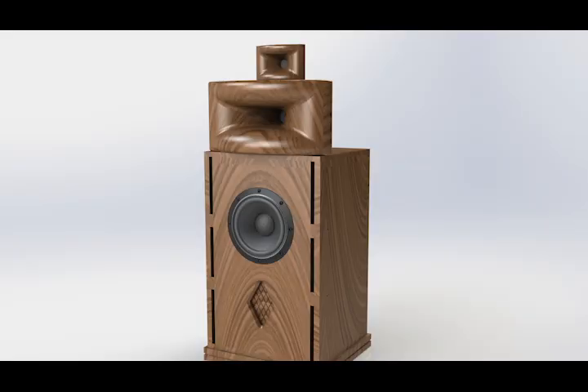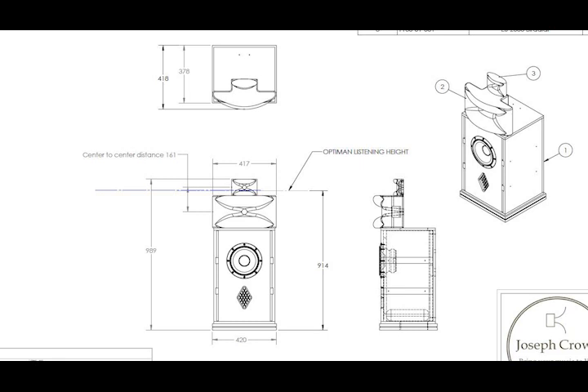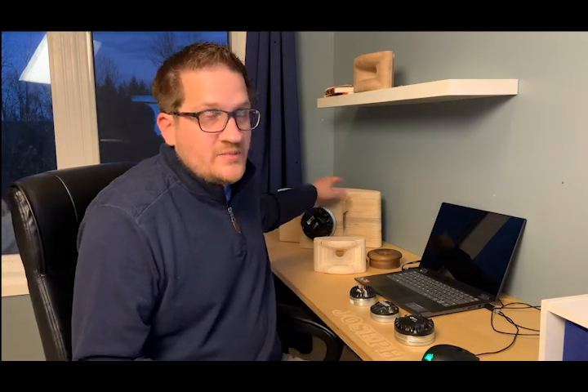The next part of the test involves the Autumn Series — a small three-way system I've developed featuring an 8-inch driver. The idea is that you can mix and match different bass cabinets with different horns to get horn-speaker sound quality in a smaller package. It horn-loads down to 600 Hz using the mid-range horn.